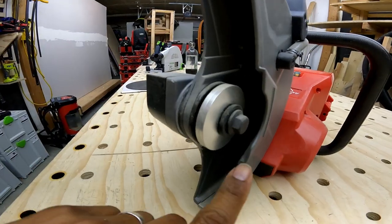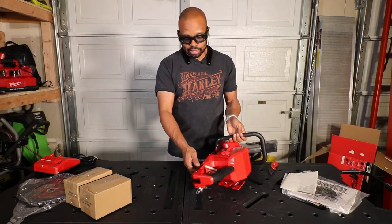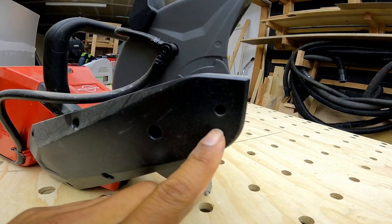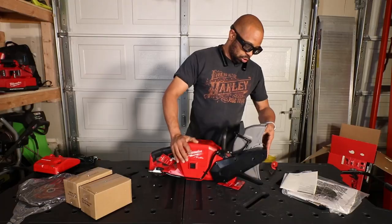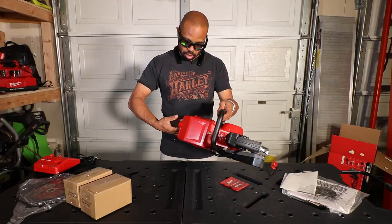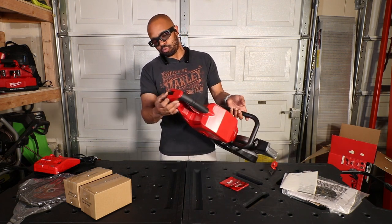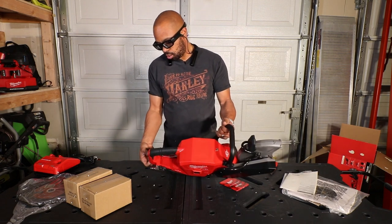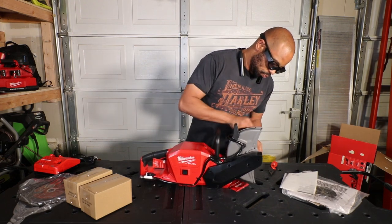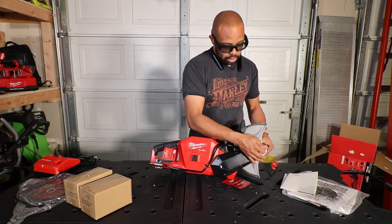You've got your arbor nut here to place or remove your blade. This saw has an Allen wrench which you put in here to lock the spindle so you can take off the nut and change blades. There's a safety trigger — flip this up and squeeze. The wrench sticks in, you turn it a bit and it slides in and locks.